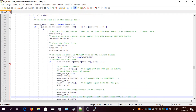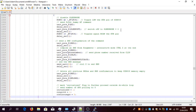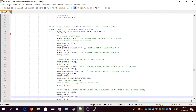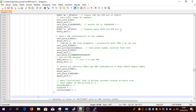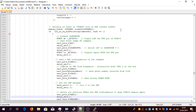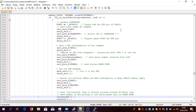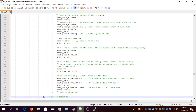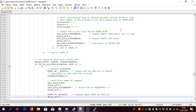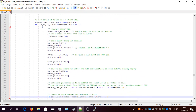There are four text commands. One is 'activate', to store your phone number that will be validated when a voice call is made to the device. The second is 'single', which gives a single GPS tracking position. There's also 'multi', which gives five concurrent measurements in 3 to 4 minute intervals. And the last command is 'guard' — which means it will guard your vehicle. If you send 'guard' to the device, it will constantly check the GPS position, and if the position changes by 300 meters or 1000 feet within one minute, you get a text message that your vehicle was stolen.